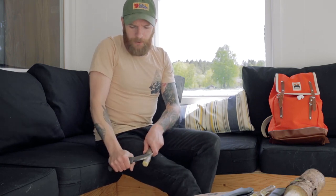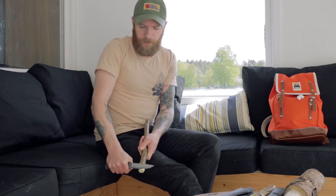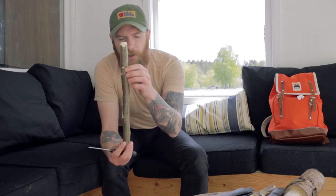If you wanted, you could also just do downward cuts with a full grip — not as much finesse with that one, but it's a more powerful cut. If the wood is not as green and it's a bit tougher, that might be a better way of achieving it. But this is nice soft green hazel so it's easy to just remove material like that — and that's the top done.